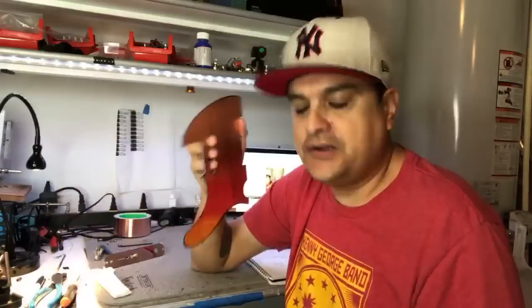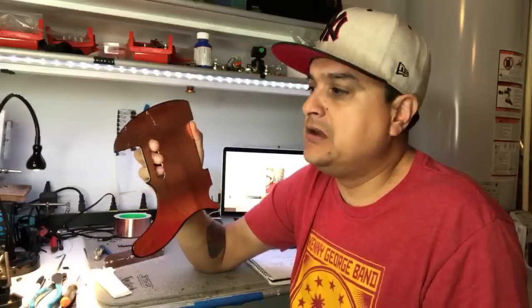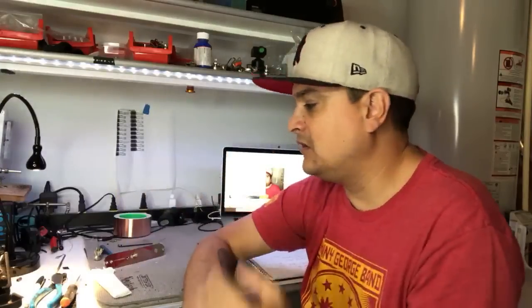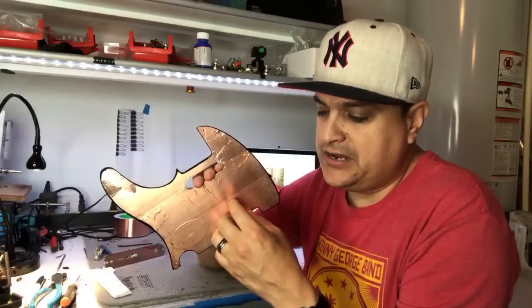However, there again, there has to be voltage and/or current for eddy currents to exist. And in a guitar, right at the pickup, and we're talking 150 thousandths, or 100 thousandths, or 90 thousandths away from the top of the surface of the magnets, you can introduce eddy currents with a regular pickup cover. You can do that. It does happen. The minute you move it from 50 thousandths away to 190 thousandths away, the effect of that drops off so dramatically that it's a non-issue.